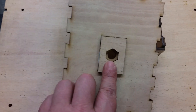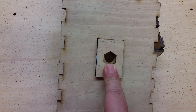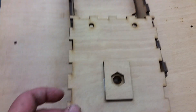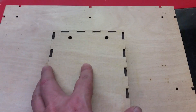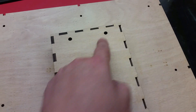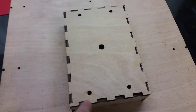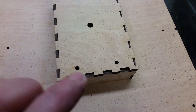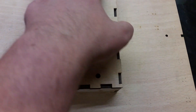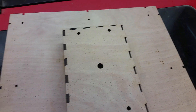On the back, there's a recess designed to glue an M10 nut in. When you turn it over, the M6s come all the way through to the back. That sandwiches everything from the very back — i.e. the plate you're actually doing the hanging from — right the way through to the front. You put your nuts on, the M10 is glued in, and that gives you the ability to hang the panel.